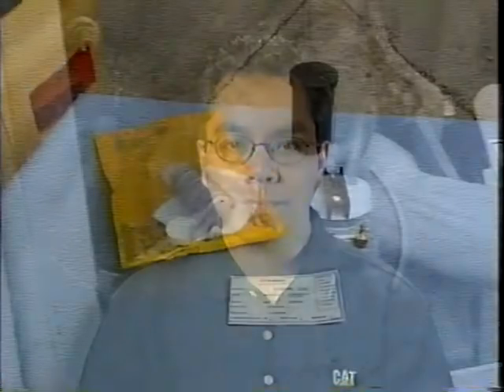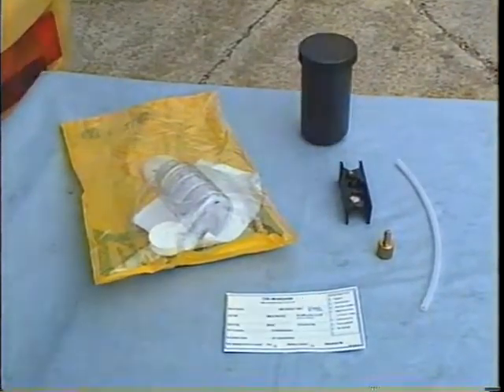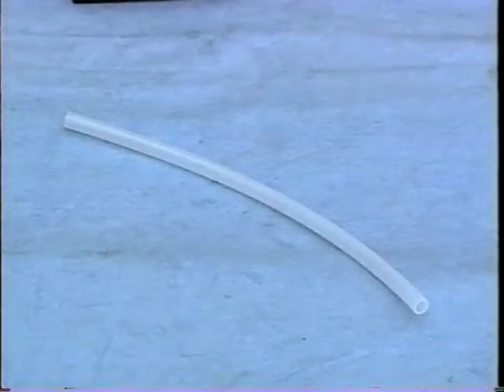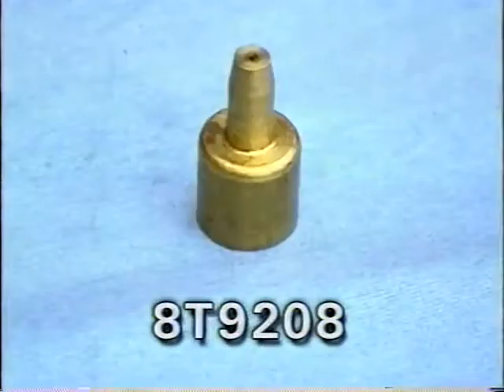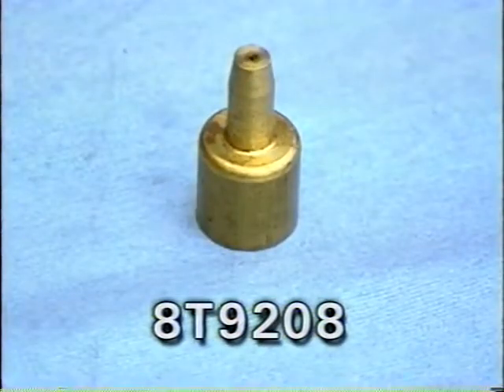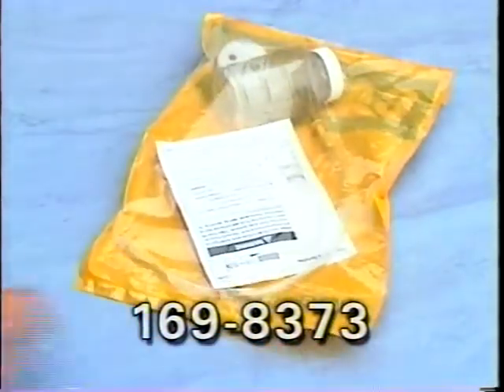Sampling using the sampling valve is the preferred method — it is faster and more reliable than using the vacuum pump. The oil samples should be drawn with a new piece of tubing for each compartment. The tubing should be about six inches long and should be cut with a tube cutter. You will also need a brass probe to place on the end of the tubing, or you can use the pre-packaged bottle, lids, and probe and tube assembly.